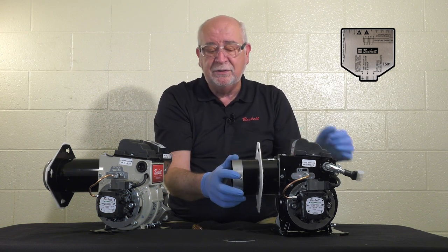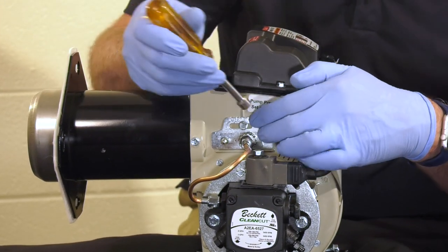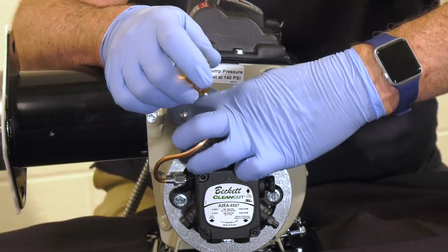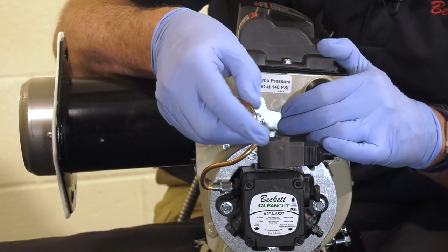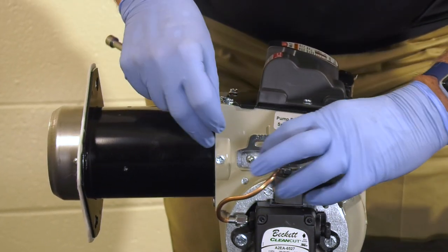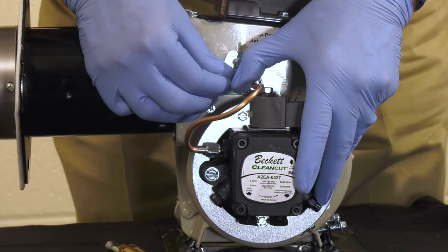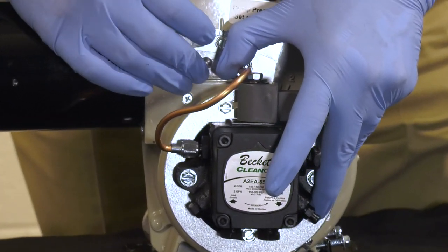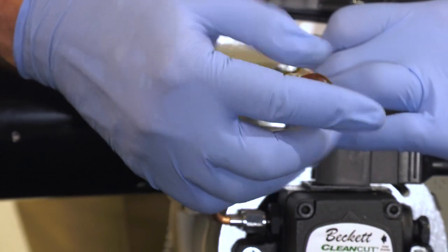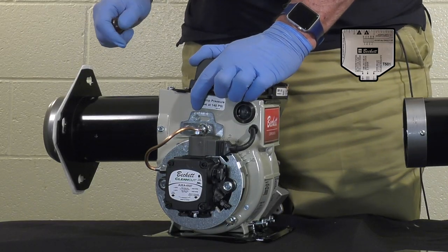When working with the V head, use the two-piece plate. Loosen up the spline nut first, then take the 5/16th nut and bring the escutcheon plate out of the detent. Move it to the zero position, drop into that zero notch, and tighten it up so that you are on zero on the adjustment mechanism.